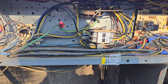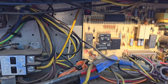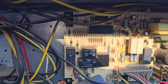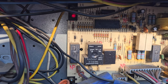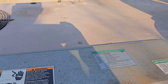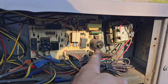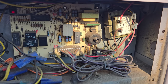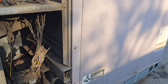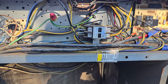Now we need to put an amp clamp on the compressor. Look at that — we're getting an error. Two flashes — that's for the heating circuit though. Shouldn't really affect us. Limit switch fault. Not my concern right now because we just need cooling. You can also see the heater's been disconnected — there's no electrode wire going down. This thing's just trash. It needs to be cleaned. It's probably got a bad heat exchanger too because it's turned off, and usually I'll disable the unit when it's bad. That's probably what happened.